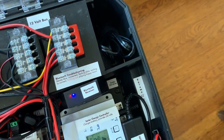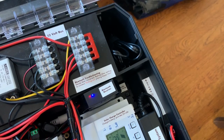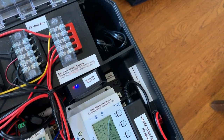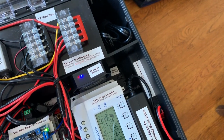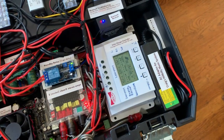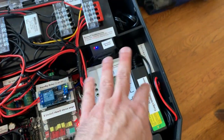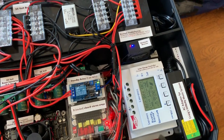The audio preamp down here is just a car stereo preamp I'm using. It's really there to split off the frequencies for the sub and to control the fader volume between the four speakers in the grove. The Bluetooth receiver and the preamp both run off the 12-volt bus, as they wouldn't take a 24-volt input.